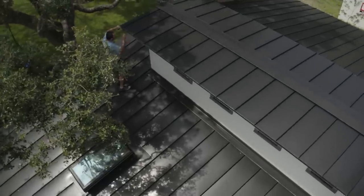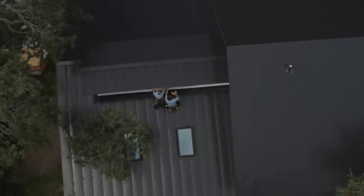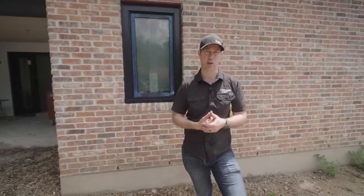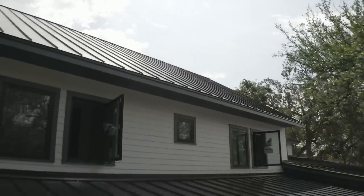For my house, and what I'd recommend for you, gutter everything you can. I'm doing basically everything at my house except for my awnings. I have some awnings on the gable sides of my house that have metal roofs on. I'm not guttering those because I'm really just trying to protect the doors themselves. But every other part of my house that has a 2-foot overhang, I've got gutters on every part of that.